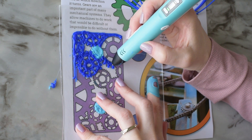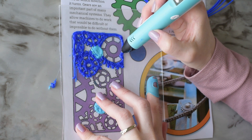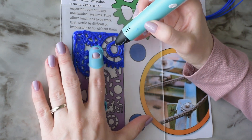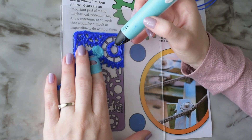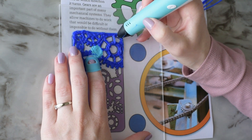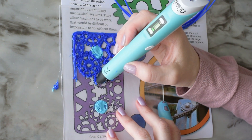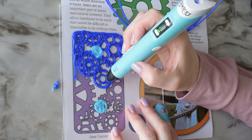To start with the basics, gears are a really simple machine that is technically a wheel with teeth. The main concept of simple machines is to change the magnitude or the direction of a force without adding any additional energy into your setup. Gears are really helpful in transferring a force, especially a rotational force which is called torque. Gears can change the torque, the direction, or the speed of the work you're trying to do.